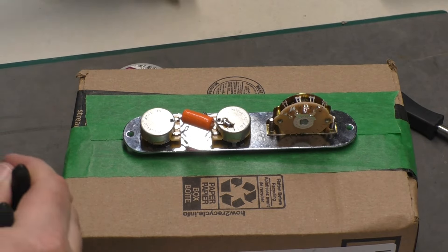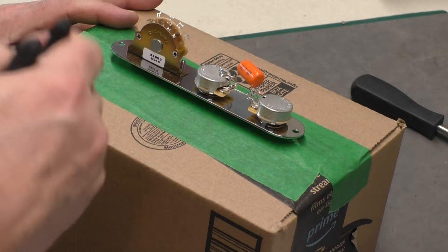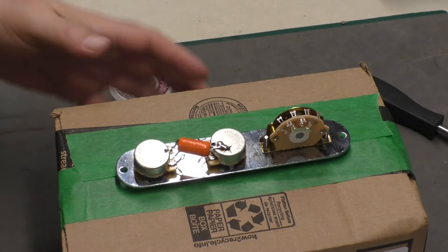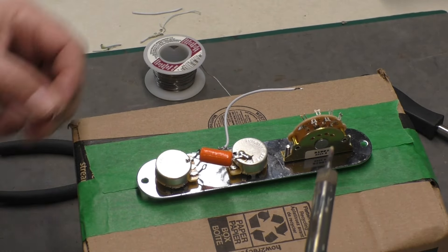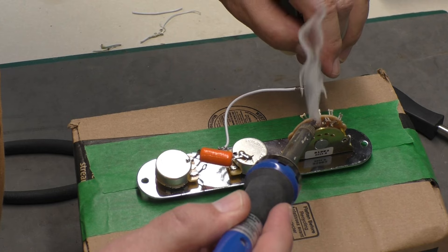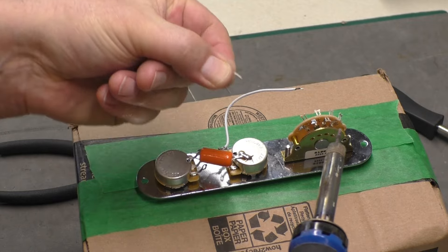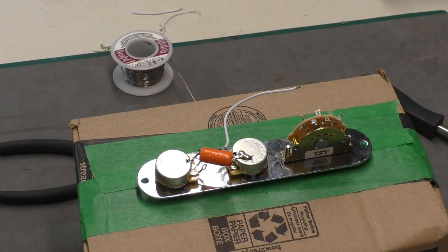There we go, that was step two. I turned it around to show you — I've connected the two first lugs here. That little piece isn't touching anything, which is good. Turning it back to the correct orientation: before I attach that wire I need to put a little jumper between these two lugs right here. I'm going to solder these lugs and add a little more, and I've made a little jumper in a U-shape — I'll probably need some pliers because this will get hot.